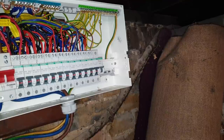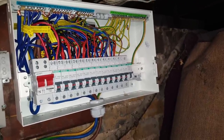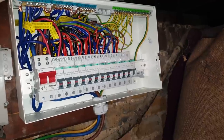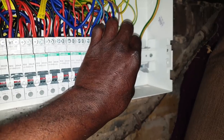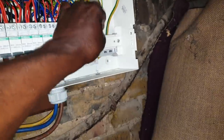If it does work, then obviously we know there's a problem with the fan — which I think the fan's got to be changed anyway. I'll have to leave it on an MCB for now until the fan is done, because it works on the MCB, but obviously the RCBO picks up the fault. Right, moment of truth. RCBO in place. Bang! Straight away — no problem. Staying in. Let's go see if the lights are working.